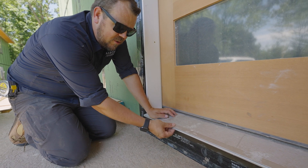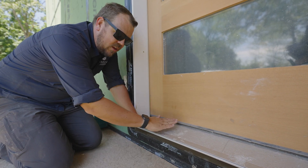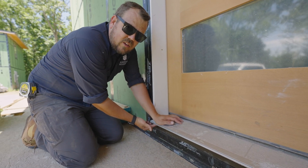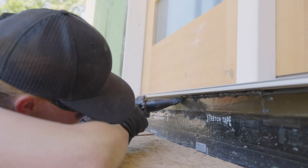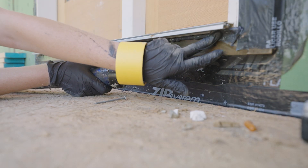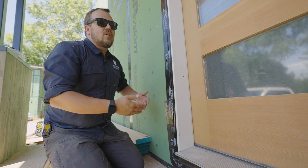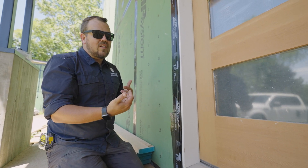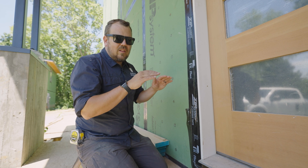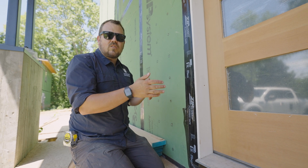If you're familiar with aluminum sills, they're not a solid block of aluminum — there are fins that grow in height to support the angle of the aluminum. We happen to have one of those fins hanging down low enough that we're literally just going to take a bead of liquid flash and run it all the way across, and then cap it on the end. That'll connect everything, and we don't have to try to take a piece of tape and seal it to that quarter-inch bead. This gives us water management on the side and water management below. We're pulling it out to the face. I think I would find a different way to do this if this door was exposed in a two-story walkout or something like that, but here we're able to scale it back a little bit, and because it's a little finicky, Aero Building's going to take care of it instead of our framing contractor or siding contractor.